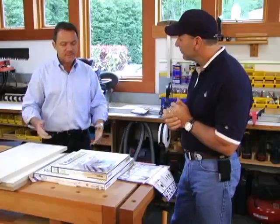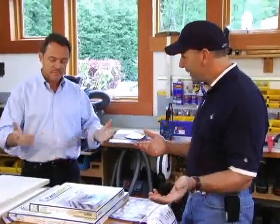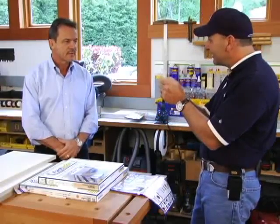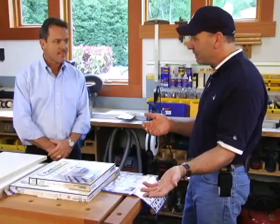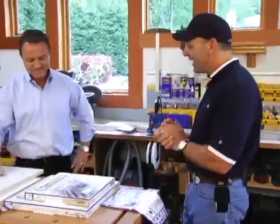All the different colors it comes in, all the different species it comes in, all this has the adhesive already attached to it. If it's Fastedge, that's correct. Otherwise it'd be just standard edge banding. What makes Fastedge Fastedge is that we take a standard edge banding and apply our adhesive to the end of it. And the reason why that's relevant compared to iron-on is that iron-on is made with melamine paper, and melamine paper cracks and it's not flexible. Ours is super durable, so we get the best of both worlds. We get the durability of PVC with the ease of peel and stick over using an iron. So that's the big advantage on that.